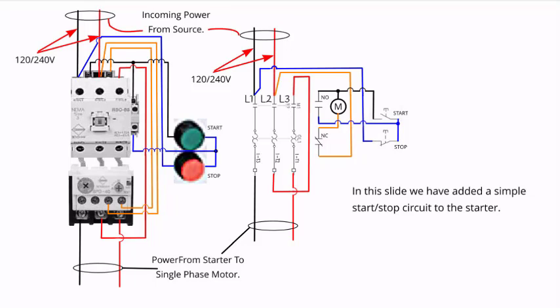There are several ways control can be achieved, and shown here is just one of many. As you can see, the starter overload protector is connected in series with one side of the coil, which opens with a fault causing the starter to stop. Of course, the normal start-stop circuit controls the starter normally.